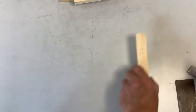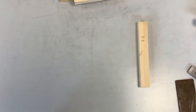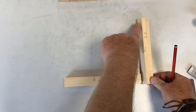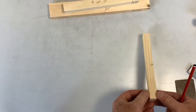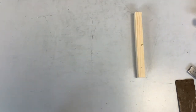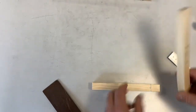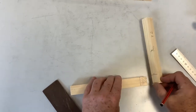The next piece is the right hand rail — I've marked 'right hand', my name, and my facing edge, positioned the way it will be on the final model. This rail has a mortise at one end joining to the base rail, and a half lap at the other end joining to the top rail. For the mortise: it comes up 25mm, the same width as the wood, so mark 25mm up from the bottom.